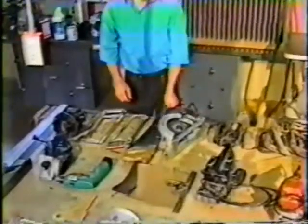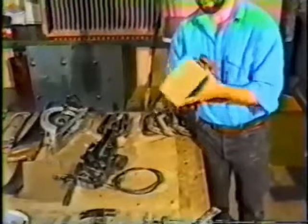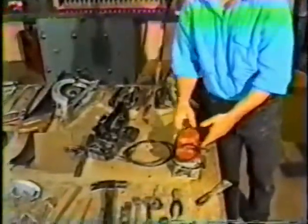Now, let's go over the tools you are going to need. For the final cutting of the oversized pieces, you'll need a scroll saw, a circular saw, a cross-cut hand saw, and a hacksaw for cutting bolts to length. To shape the handrails, a router, a drill motor for drilling holes and installing screws, an assortment of twist bits, and a hole saw. For sanding and finish trimming, an orbital sander and a belt sander. You will also need a caulking gun and at least five five-inch C-clamps.